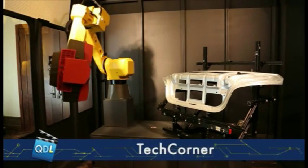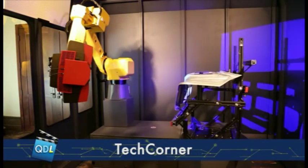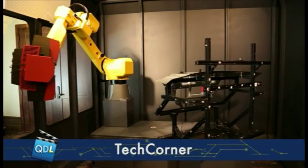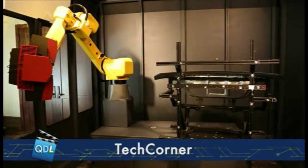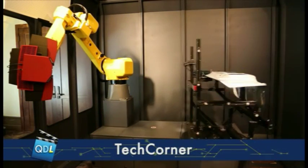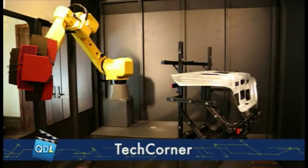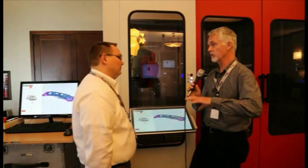Right now it's going to value all the points of the frame. The first time we run this, we can value all of the dots, and after that it could just be part scanning. We want to make sure the points we're using for the actual scan are accurate. If there's any change to the fixture, we want to be able to revalue all of those little white dots and make sure they're in the same position. After this it'll go into the actual scan, and then the next part you run, it won't need to do the photogrammetry — it will just scan the part.